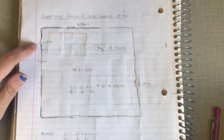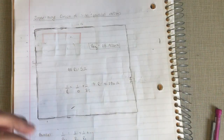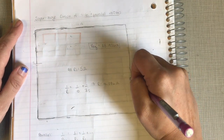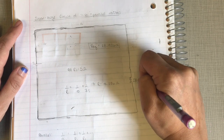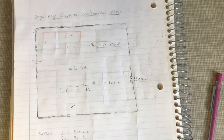Adding those final series resistors: four point two eight six plus two point five plus twenty two point one four gives an equivalent resistance of twenty eight point nine two six ohms for the entire circuit. Even though the original circuit looked super big and scary, taking it one piece at a time makes it manageable. The whole thing behaves as a single resistor of twenty eight point nine two six ohms.